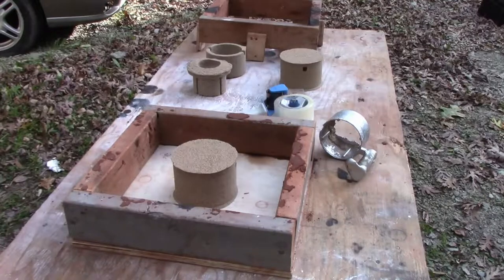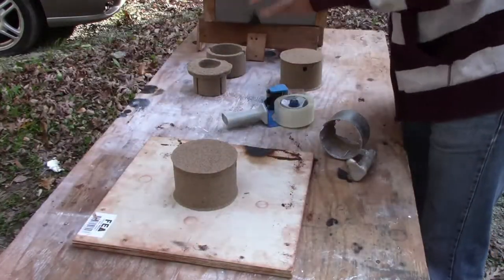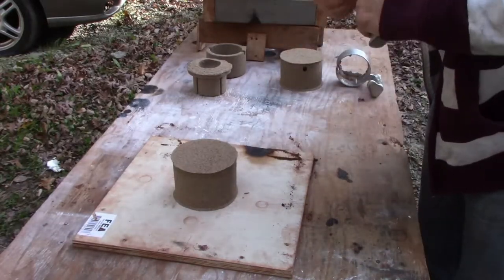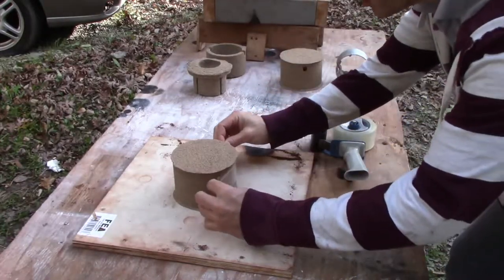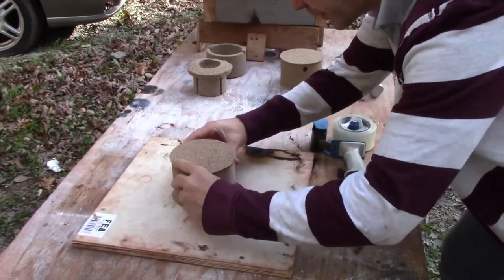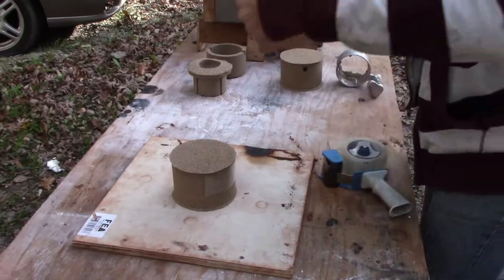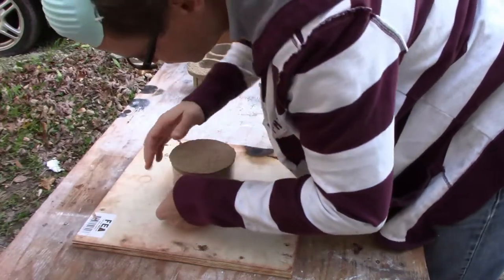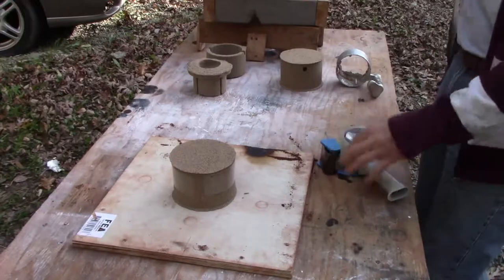Okay, to start with one of these molds, I have pre-made molds. These are for regular molding operations, but it's a little different when you're doing these. So what I do is I cap off the holes. You can just keep it there, Ethan, it's not moving. So then I just cap off the filling holes with tape. And the reason for that is it makes everything stay aligned.